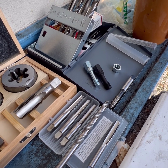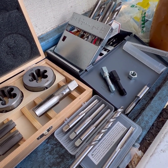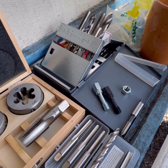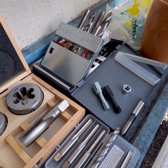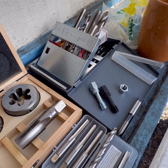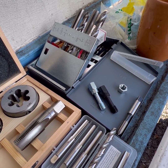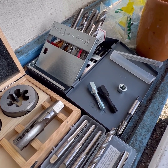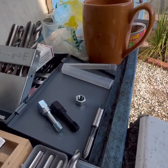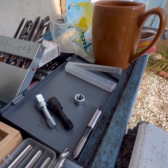Let me show you what I've got here. I didn't drag the whole set out — all the ones I'm going to show you today are going to be 3/8, specifically 3/8-16, basically your national coarse, your standard old 3/8 bolt. Now if you want to chase some threads — say you're changing an intake manifold or exhaust manifold on something early, you pulled an alternator off or a bracket, you need to put that bolt back in and the threads are ugly — maybe there's old silicone or rust in there, or somebody tried to cross-thread a bolt and boogered the threads — if you just want to chase those threads and don't want to do a lot of cutting or moving a lot of metal, Lang Tools makes a couple of beautiful sets.